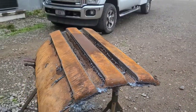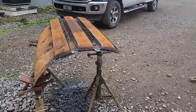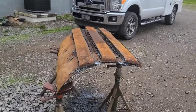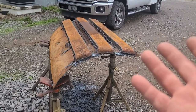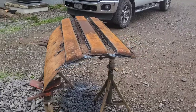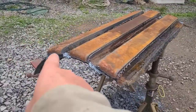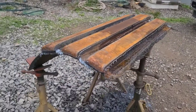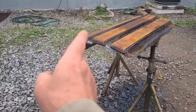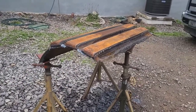You've got to think, if you want to use a track machine, you've got to watch how you cut stuff, because I could have run that track machine all the way down through there, but then this assembly would have fallen apart. If it falls completely apart, you've got nowhere to put your track. So I can leave a little metal on the end there like I did and keep the whole thing in one piece, and then I'll just take my hand torch and do a little wah, and she'll come apart.